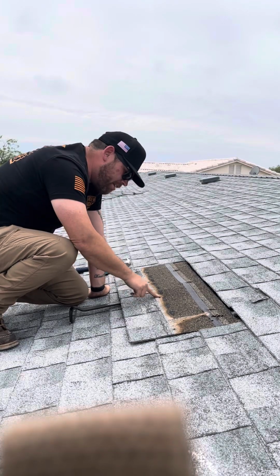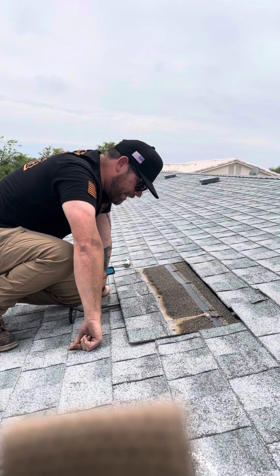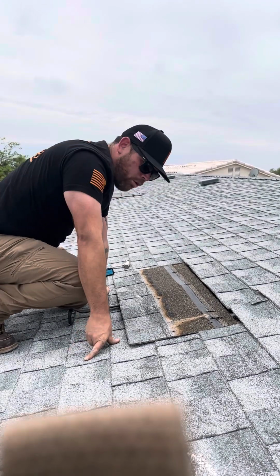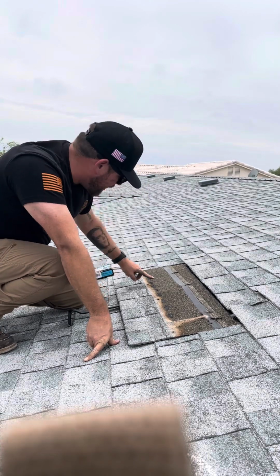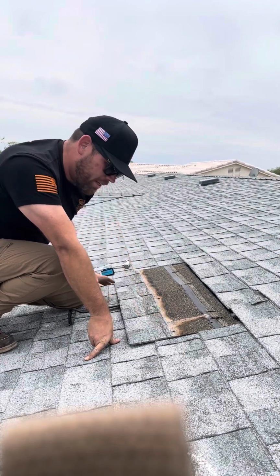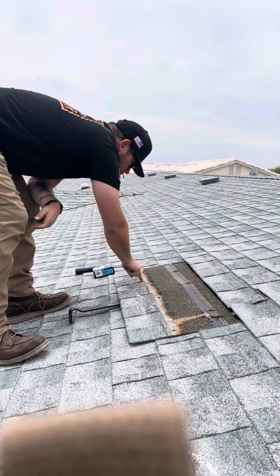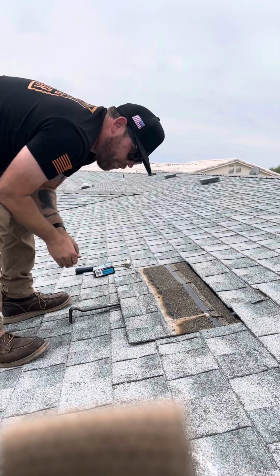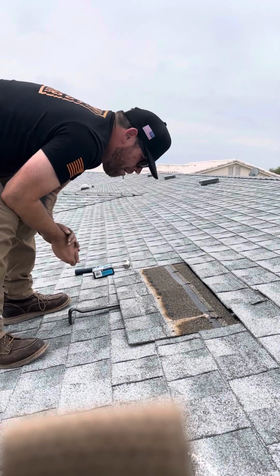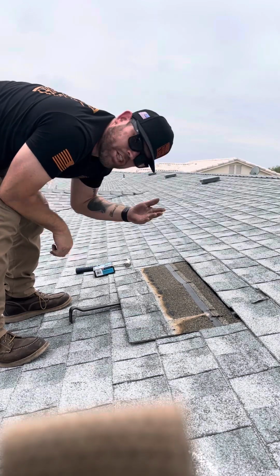This is where the adhesive is supposed to be above to prevent any leakage, and to really ensure that we're able to repair this correctly, we have to be able to get mastic and caulking in every one of these holes where water can seep in. So we have 1, 2, 3, 4, 5, 6, 7, 8 different entry points for water to get in, making it harder for us to repair this roofing system without damaging the surrounding shingles.